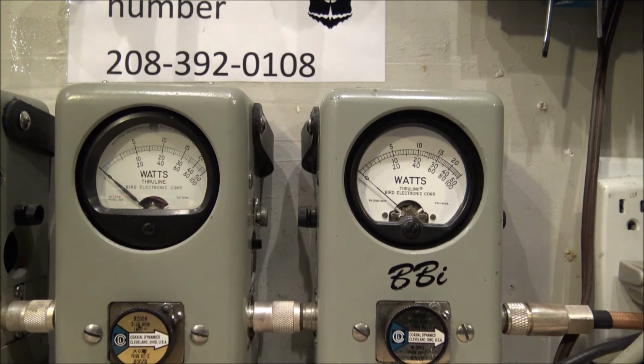You got to remember, this amplifier came out in that beautiful time in the 80s when there was still this veiled semblance of law and order in the Wild Wild West of the 11 meter or 10 meter bands, where the radios weren't allowed to do more than 5 watts. So the architectural engineers, the guys that created this little wonderful creation down there in the great state of California, never planned on having the amp driven more than about 5 or 6 watts. You got to bring that dead key down to just a hair underneath 1 watt to get the really heavy swing out of it. Otherwise, you're going to be jamming too much into it.